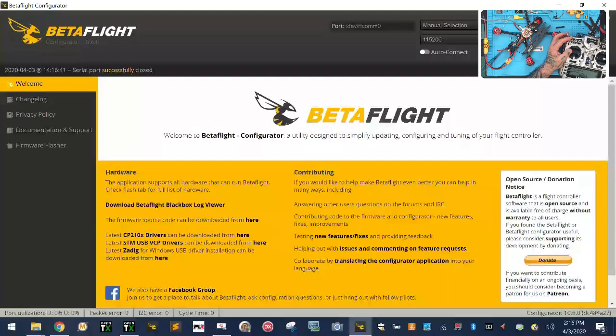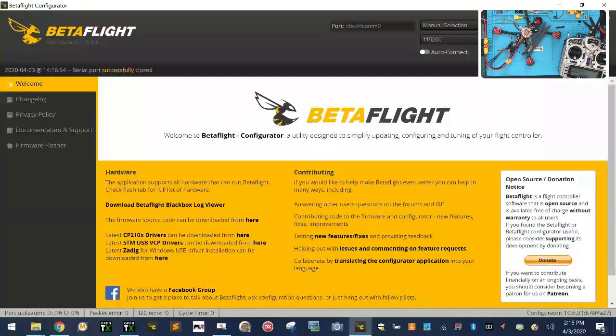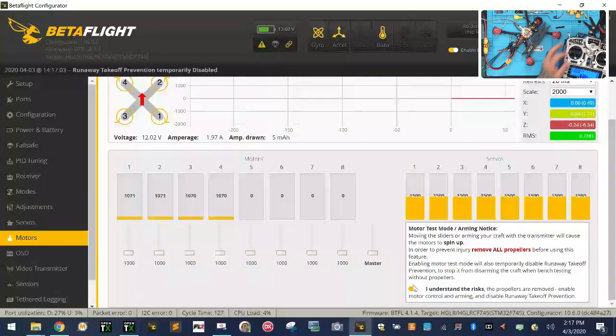And I'm actually gonna speed the motor up just a little bit, so let me go ahead and go to configuration, and what I'm gonna do is I'm gonna tell this I want to go to, let's say, 7. Click save. Okay. Connect. Now, if I go to motors now, and I click this, I should be able to, I see, there you go. So all you have to do is make it like that, and now you can see. All right, so that's good. So that's done. Everything else here looks done. The only thing left now is to get telemetry.